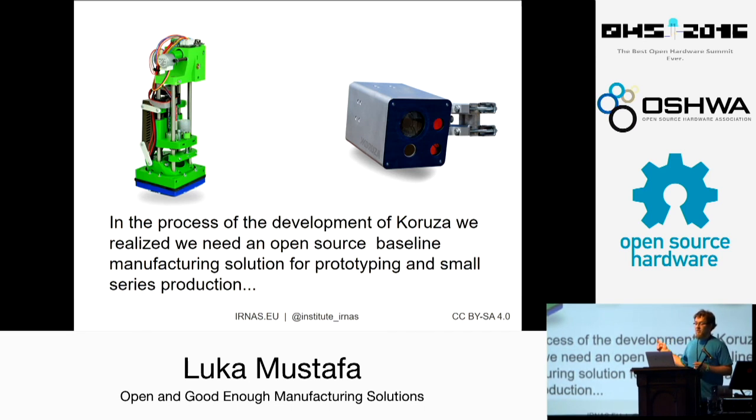With the 3D printable design, we learned that in previous versions the unit was a bit like this tall. It was mostly 3D printed in several pieces that bolted together. The biggest problem in that case was that you cannot easily modify it, because you need to change a large 3D printed structure and reprint it again. So over iterations, we came to a final solution copied from 3D printers, more or less, where we use some stainless steel rods as a common interface, and you just stack different things in the unit, and then you can easily replace the top part, the middle part, the bottom part, or whichever. This makes it very accessible, even for people who've never done a 3D printed design before. They can change something in an hour, whereas a whole big part takes quite a long while.